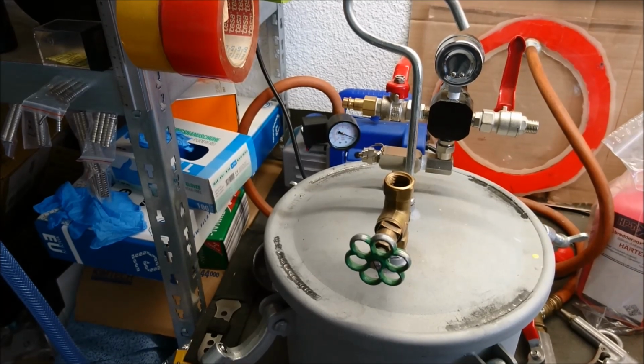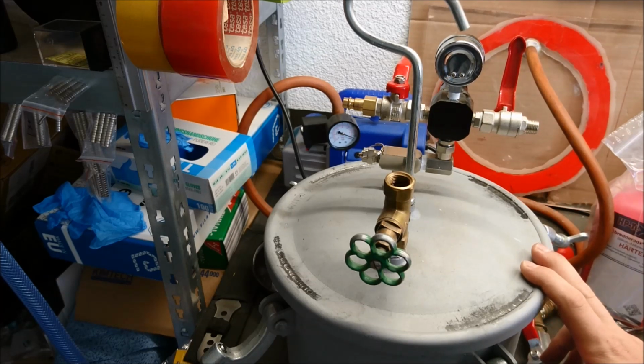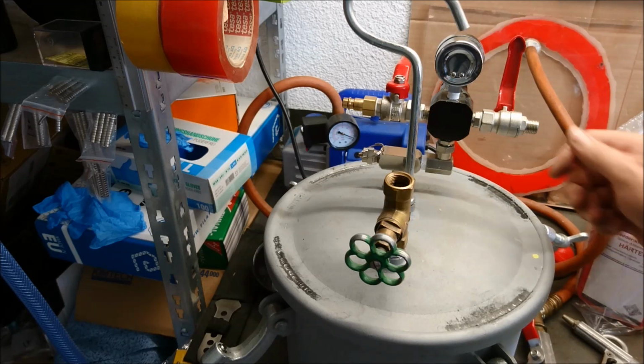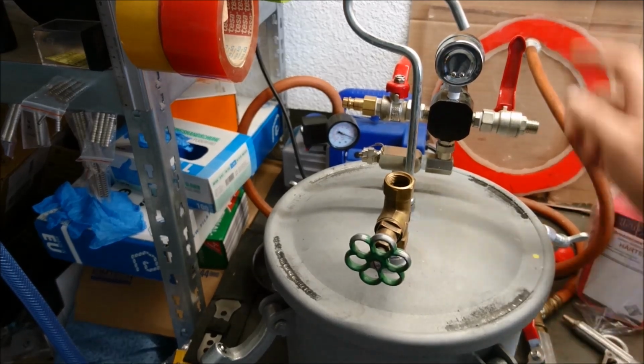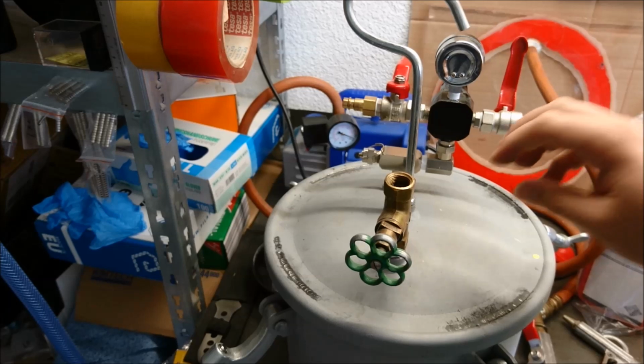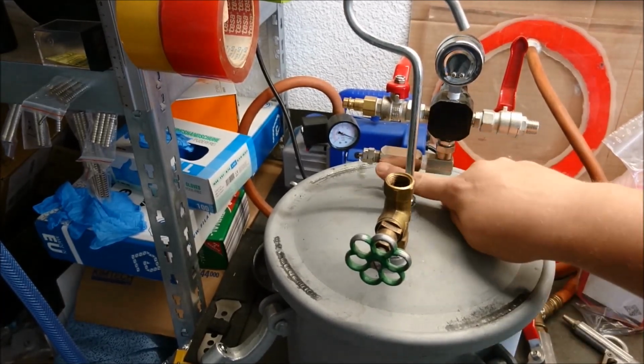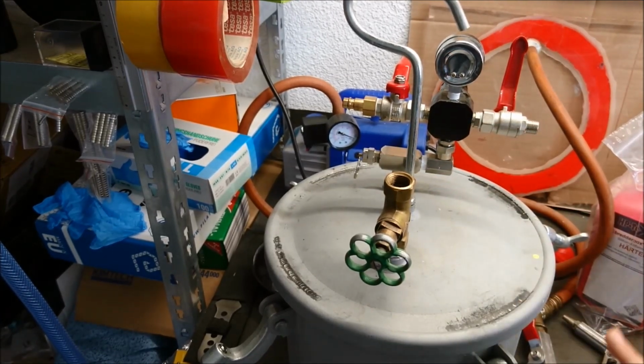I will list everything that I bought here in Germany and on Amazon, so you have a guide to find your pieces. Also make sure, if you work with something that is as dangerous as compressed air, that you don't do anything stupid. Don't blow around with a gun, or look into the release valve and open it or so. None of these crazy things. Just be aware that compressed air is nothing to play with, and anything else should be fine. Don't do anything stupid to your safety valve, and you're good to go. These things won't blow up, they just might leak something.